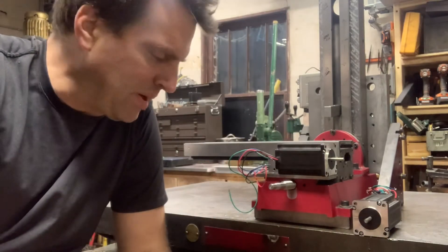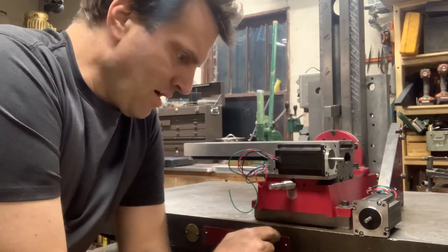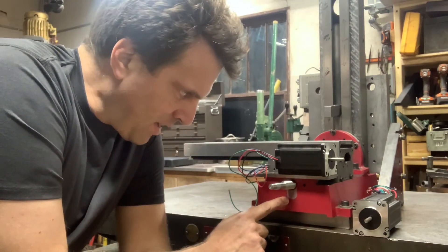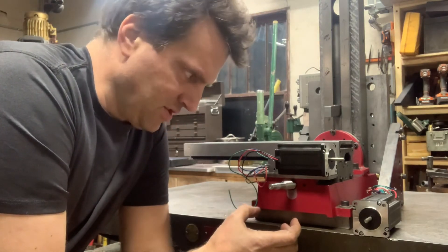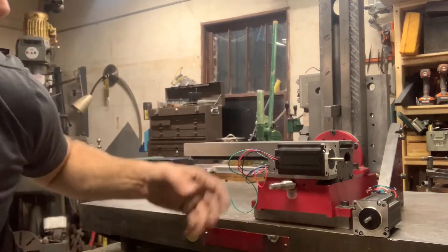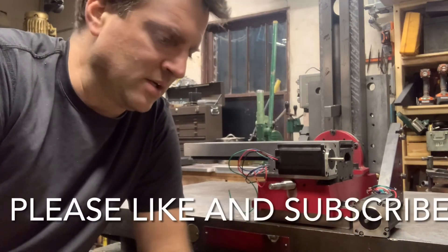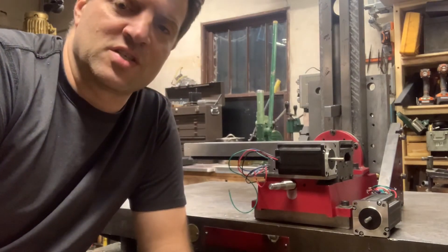This is just a giant pain in the butt. So I think my plans are — and if you've got any advice, feel free to comment, I love the comments — but I'm looking at where I colored this gray. I'm looking at milling a slot and lowering this y-axis screw. That'll give me clearance, and actually it'll make mounting on the bottom side even easier. So that's where things are at with my mini-mill project right now, and I'd be thrilled to get any comments, suggestions, or questions.